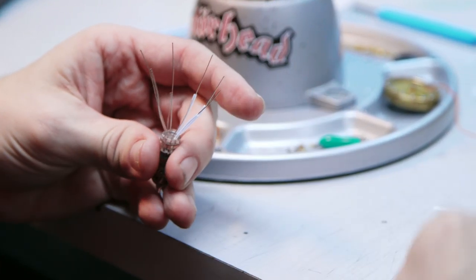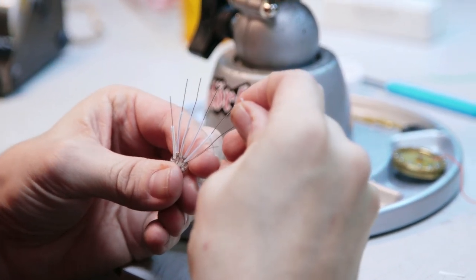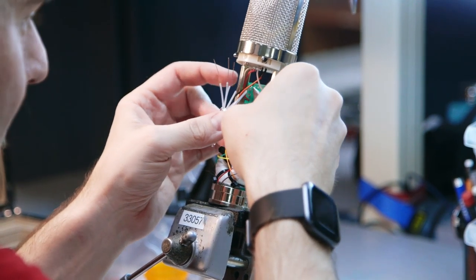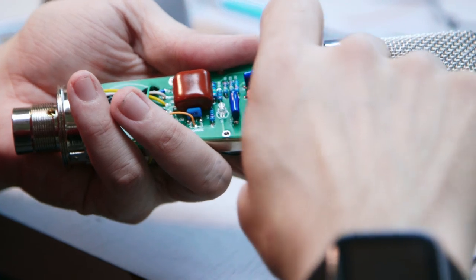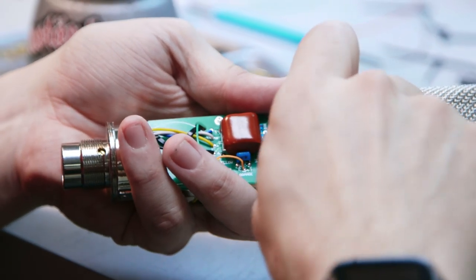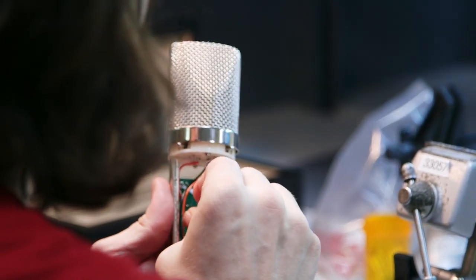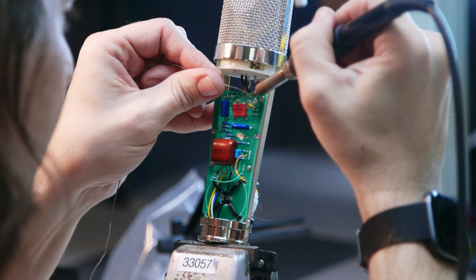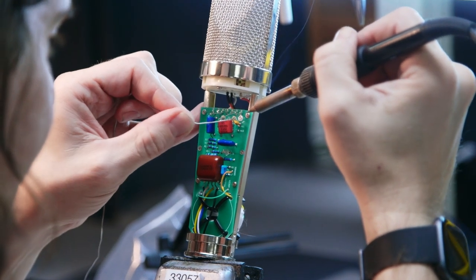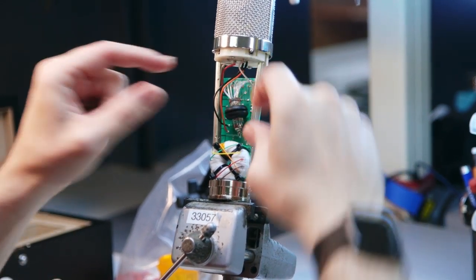Right now I'm putting the little insulators on the tube legs because it's a sub-miniature tube, so they're flexible — not like a 12AX7 that everybody's used to with short rigid legs. The tubes we use on this and all our tube mics are JAN — Joint Army-Navy New Old Stock 5840s. It's a sub-miniature tube, and David used to be a sonar technician in the Navy and has been using that tube since those days. Putting a little grommet on since it's a sub-miniature tube with springy legs, so they don't bounce around and shatter the tube.